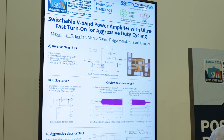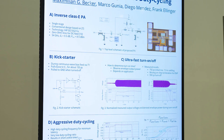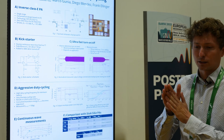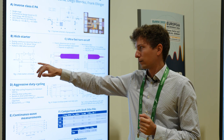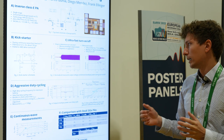This is extended with some biasing circuit I labeled 'Kickstarter' here, which first of all provides the active bias to the base, but also speeds up the turnaround phase. Two transistors operate as an AND gate with an inverter and delay to create a 150 picosecond pulse to connect the base of the core transistor to the supply voltage to speed up the turn-on process.